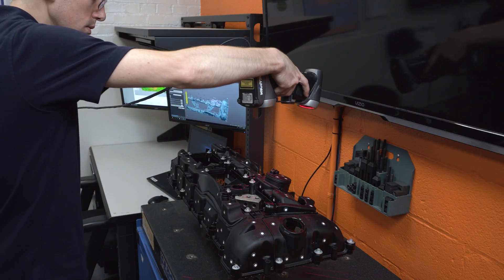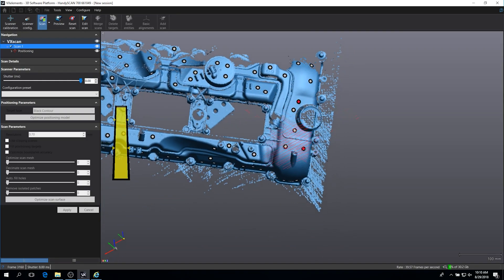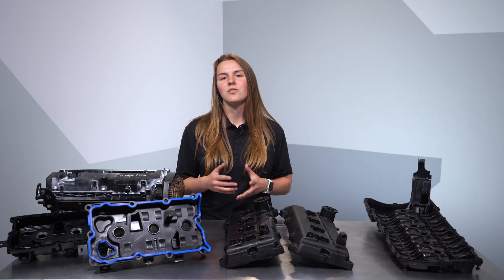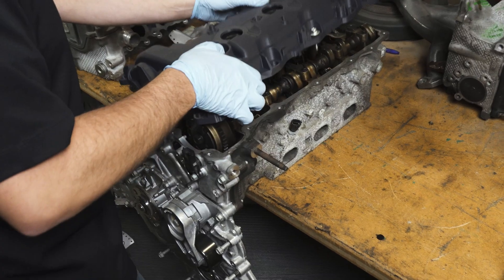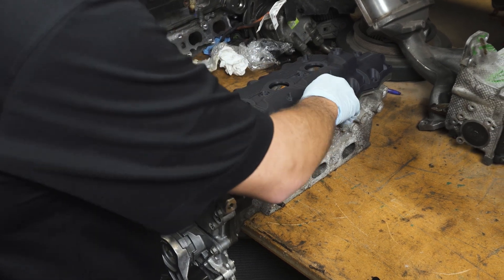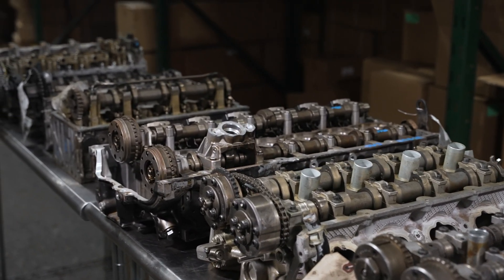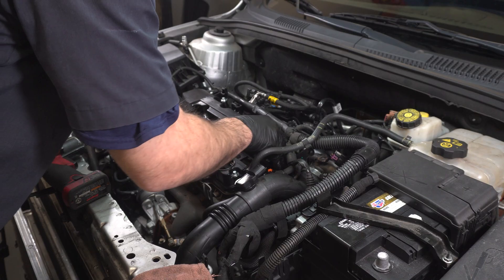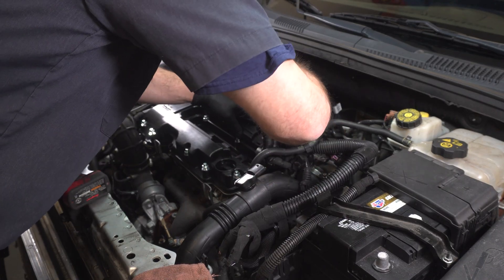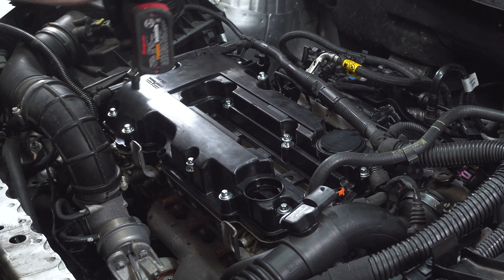All Dorman units are measured in our metrology lab to ensure proper fitment. Metrology is the science of measurement — we use complex three-dimensional laser scanners to produce a cover that fits every engine just like the OEM part. We use metrology for dimensional verification, and actual installation onto a cylinder head from our library is the next check we have in place. We have an incredible bank of cylinder heads specifically so we can check fitments and reference OEM dimensions practically in the real world. After that we install valve covers and run them on-car to validate them. Dorman covers fit right because we make certain of it with these checkpoints — both high-tech and low-tech, in the lab and in the field.